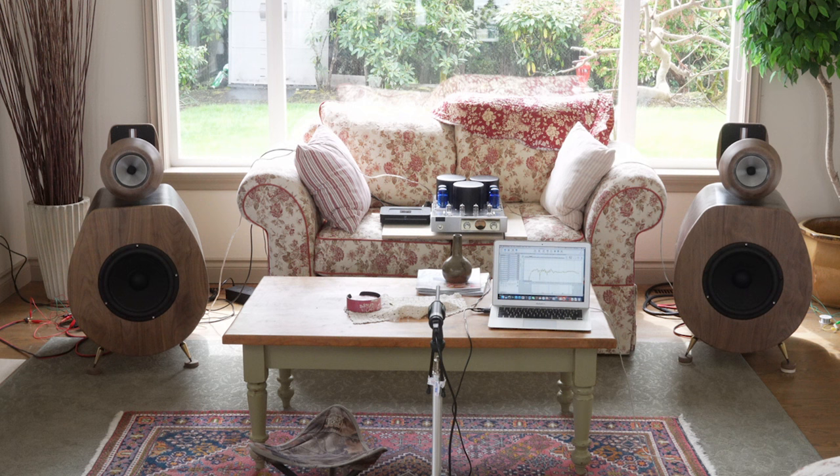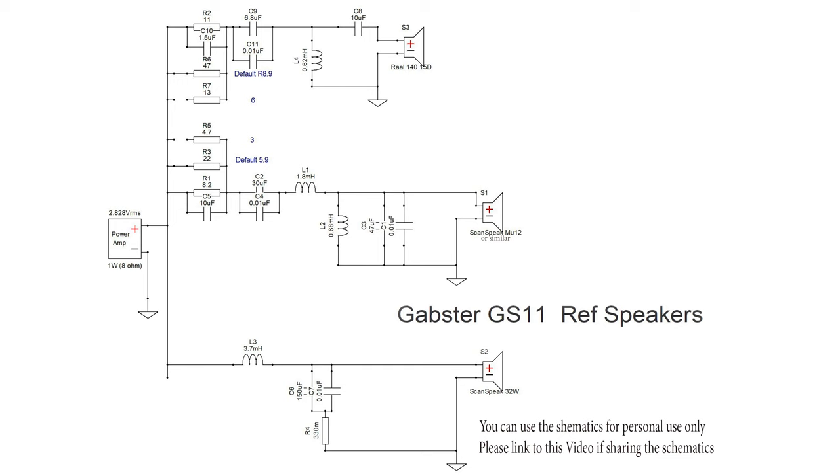I even tried different amplifiers — each amplifier's slightly different character and sound could affect your measurements. If you have a nice neutral amplifier it should be consistent, but they're never exactly the same. Once I got really close to where I liked the speakers and they sounded good, I started working on setting them up in the best listening position. Once I got that, I measured again and fine-tuned the crossover components one more time to get the absolute best sound for my listening room position.